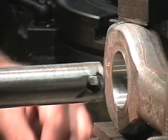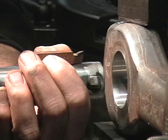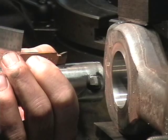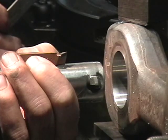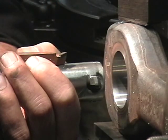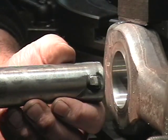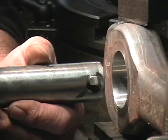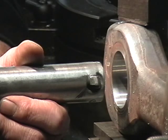Although this looks like a positive rake, this tool going back through the bar, when it's cutting, presents to the hole something more of a neutral rake. It doesn't tend to pull itself in and it doesn't tend to pull the bar forward — it doesn't grab and release. Which is one thing that is problematic with lighter bars and lighter spindles because they'll pull in, release, pull in and release and the chatter starts. I think it's worse than having wrong feed rates or wrong speed.